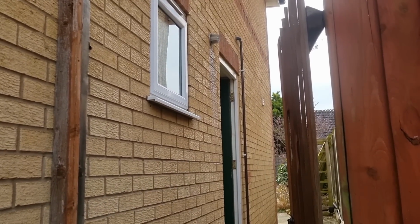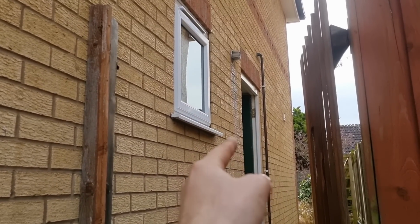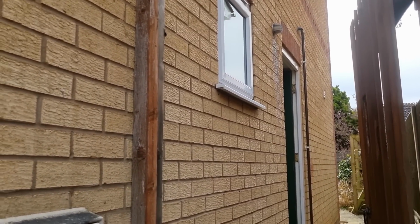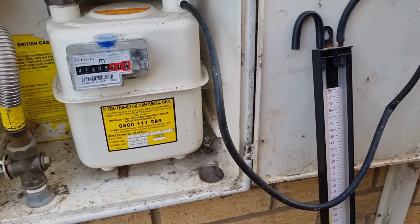That is the discharge from the unvented that I put in last year, that 28mm. They used to have thermal stores and I just put an unvented in. The coil went in the thermal store, so we converted it all to pressurised, and then the boiler's gone this year. I think the fan's gone, but they've opted to have a new boiler, which is fair enough. So has that dropped? That's going to be sound as a pound.